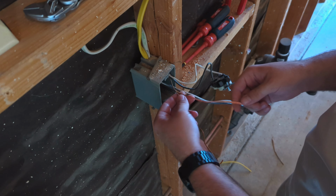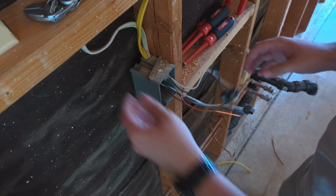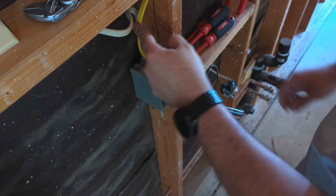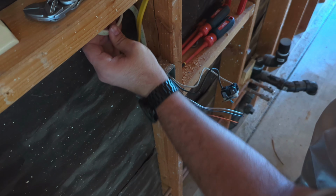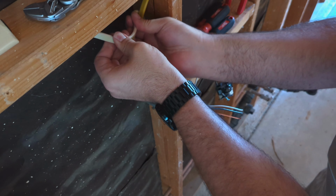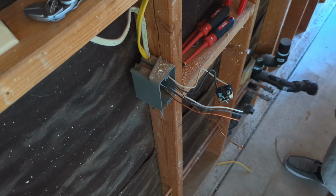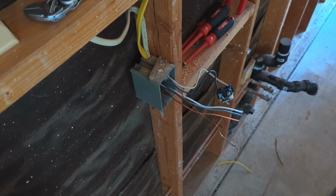So all I'm going to do here is I'm going to combine these 2 wires and then connect them there. And I think I bought 12 gauge here and this is 14. But I don't know. Yeah, this is 14. And if you're looking for that information, they print it on the side. This is 14 here, and I bought 12. Yeah, 12 too. And this is 14 too. So I should really go back and get 12 so it's not mismatched. All right, be back.